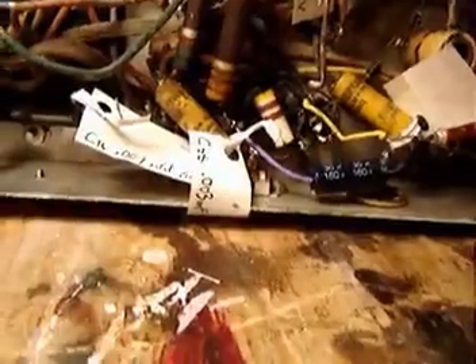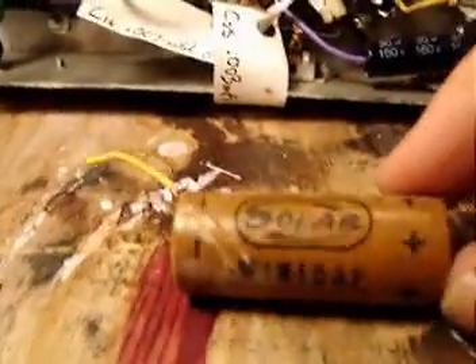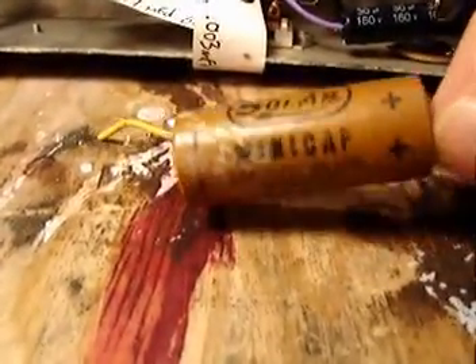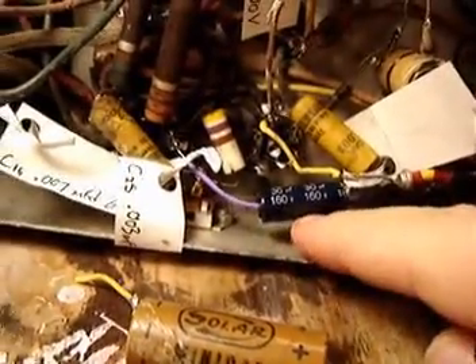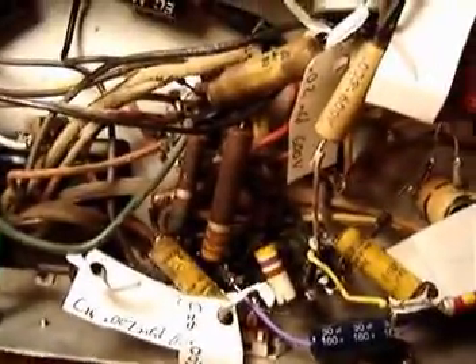The other one I replaced is down here. I'm going to replace this little electrolytic capacitor — he used to be right here, and he's gone in there with a little bit of shrink tubing and some solder. That's it. I'm not going to go any further than that right now. Let's flip this thing over and see how it sounds.